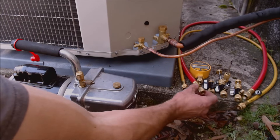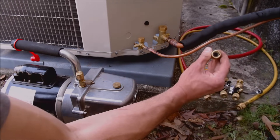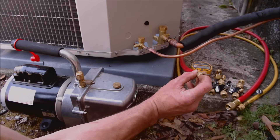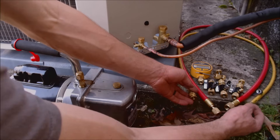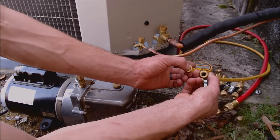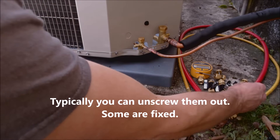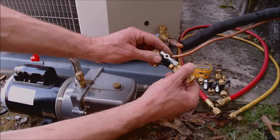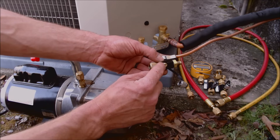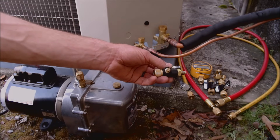In reference to the hoses, we're using a 3/8 hose here — this side is 3/8 and there is no valve core depressor inside. This side's quarter inch and there's no valve core depressor in there either. Our second hose also has no valve core depressors on the inside. If you have a hose that has one in it, you can actually just unscrew them out. We use three valve core removal tools — these are Appions, rated down to 20 microns. I always take the Schrader valves out of the side; I don't really feel a need to have them in. I use three of them and I don't use a manifold gauge set.